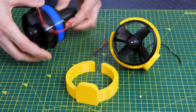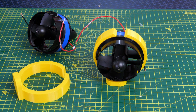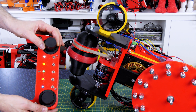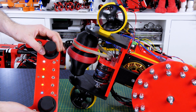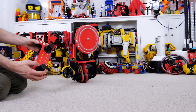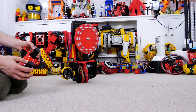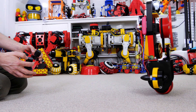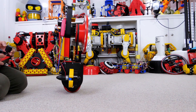It's ducted fans — 80mm ducted fans with brushed motors with just two wires, so they're easy to drive, and I've made mounts with a base to stick them onto the sides. With the addition of an NRF24L01 radio chip and a motor driver we can now use the Opendog 3 remote to run those fans. One runs backwards while the other goes forwards, which isn't ideal, but it should be enough to push air and cause the robot to rotate and steer. I can also drive backwards and forwards with the stick on the remote by offsetting the set point, causing it to lean and then drive to catch itself. We are seeing some yaw movement due to gyroscopic precession from the reaction wheel when the robot is moving.